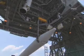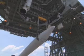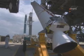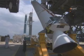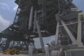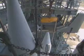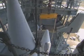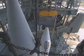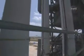They're lifting up the first of the solid motors. This is a 79-25 rocket, which means it's a Delta II with nine solids — they also have three and four solid configurations. They take the solid motors and pick them up with the tower crane, mount them on the mobile service tower about three at a time. Then they roll the tower up around the vehicle and transfer the solid motors from the service tower onto the rocket, where they'll be bolted on for launch.